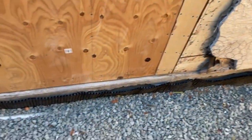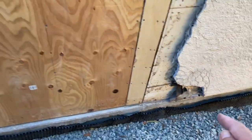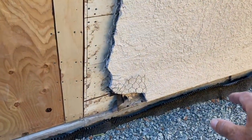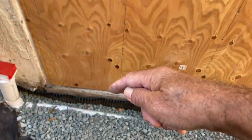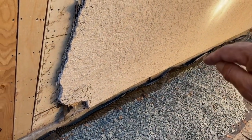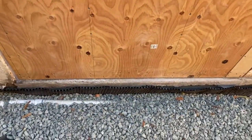We've got a bunch of issues going on. We had a French drain put in last year as well as the drain for the downspouts. This membrane here goes up against the house and then down underneath the French drain, and it's backfilled with gravel. I've got to figure out a way to get that membrane attached to the concrete so it's a watertight seal, because in other areas of the garage the way they redid the old carport, when it rains, water sometimes gets underneath the plate. But at least in this area I'm going to seal it so water won't get under there.